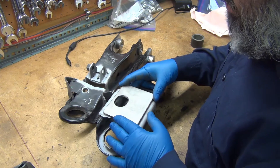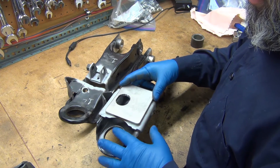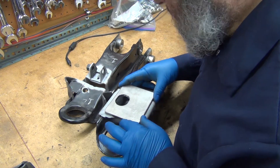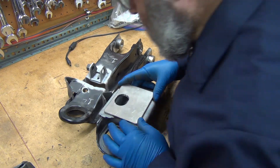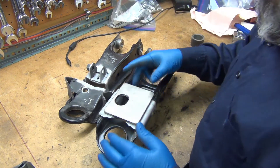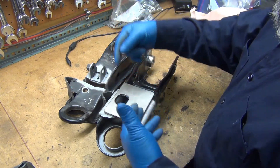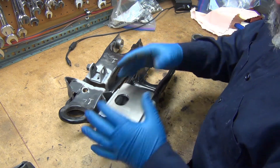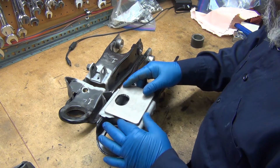I don't send them with the ball joint in because I don't want to get too hot around here when welding. So right about there is probably going to be about right — centered left and right is fine. I'm kind of torn about tacking that on because then you've got to cut it off to finish weld the bottom. I was thinking I'd tack it so you know the position, then you can just line the tacks back up.